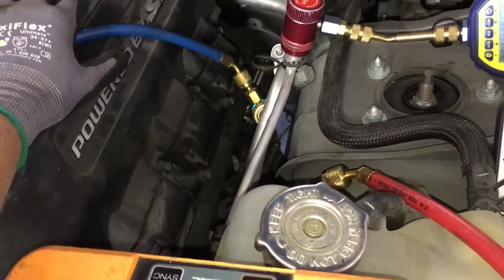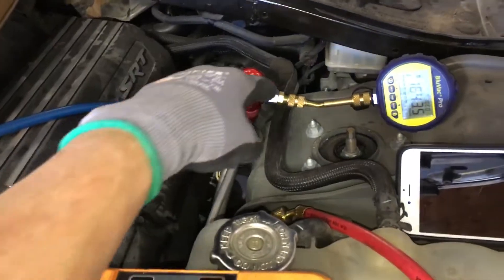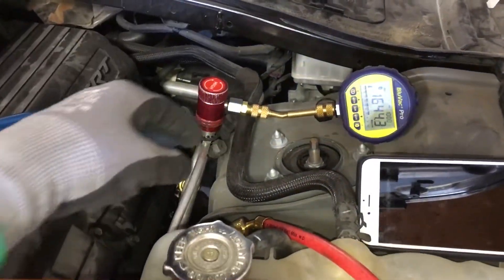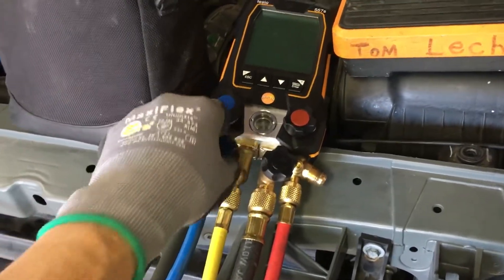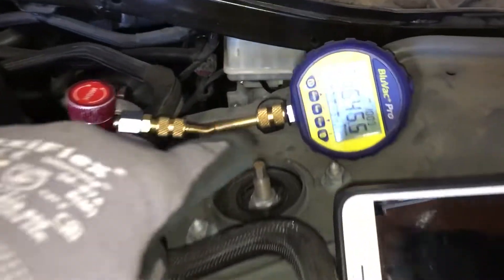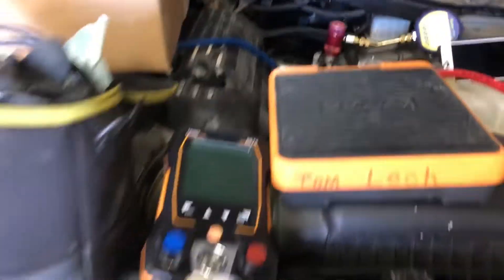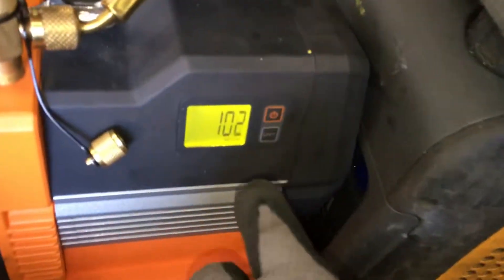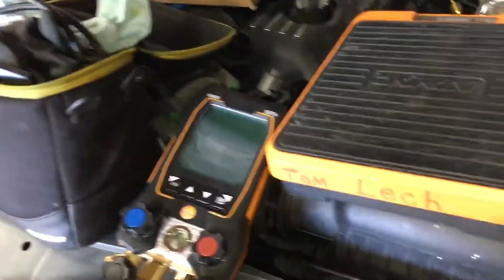That was the most important thing I wanted to show. It happened to glitch out on me and not connect, so I was getting a little frustrated and switched over to something I know will always work. We got 1600 microns there — let's open them back up, the vacuum to the system, so we can start pulling back down again. And there we go, we're going back down. We're at roughly 100 microns here. We have 1600 microns there. This is why you don't put micron gauges anywhere outside of the system.